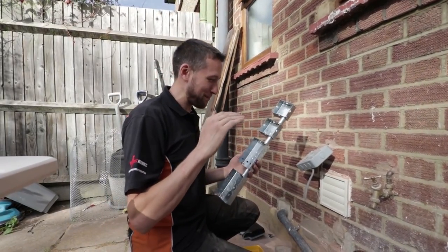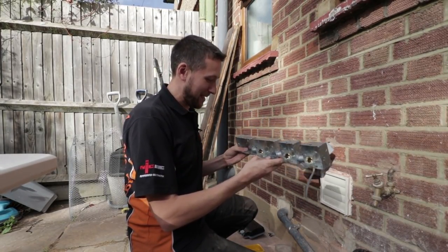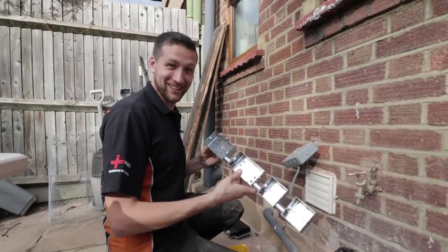We took the idea from some of the people in the comments about how to level up back boxes and stuff, and this seemed to be the way that everybody was saying. It's a good way of doing it - just use a 20mm metal coupler in the brass bushes. It works well.